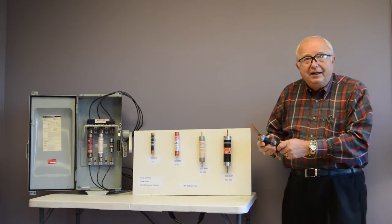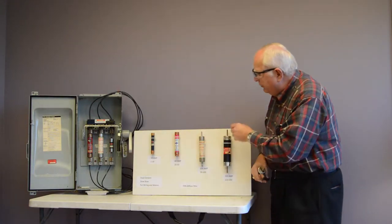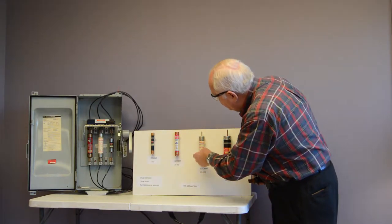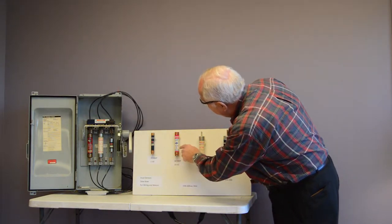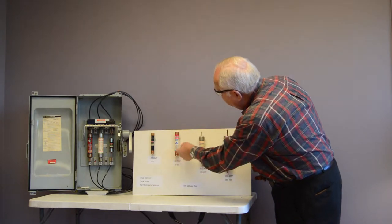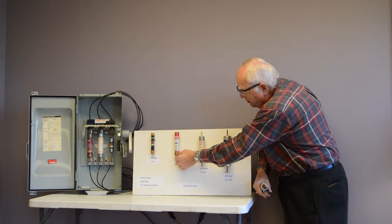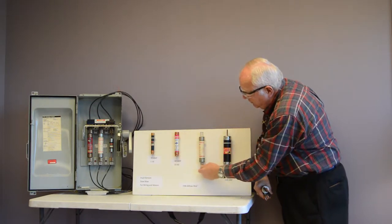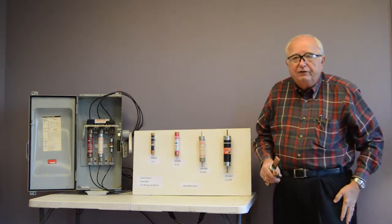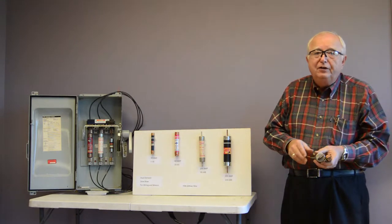So, that being said, FRS, FRN, as you change manufacturers, the FRS may change. Like this is a Shawmut fuse. It's a TRS60. The R means rejection. That's the rejection clip. On these, it's this little hole. Those are there so if the switch is properly set up that you don't install some other type of fuse.